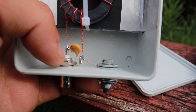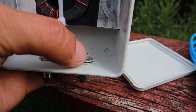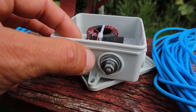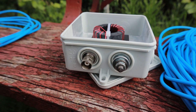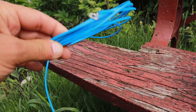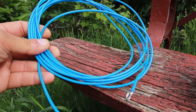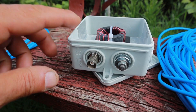From the ground connection I have another wire going to this screw, and here you can either connect it to ground or, in my case, I'm going to connect it to another piece of wire about four meters long as a counterpoise. Pretty much this is all the antenna.